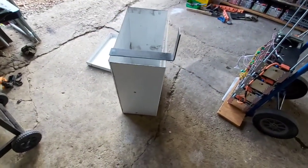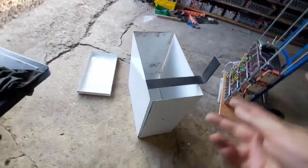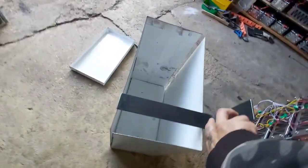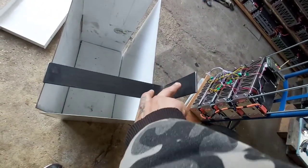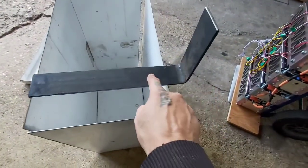And I did get the angles made as well. So these are the brackets that are gonna hold this together. And then it'll keep it another inch off the wall. Those will also get drilled to match the, there will be a cover on there, so I won't have to worry about where exactly that lands. But I'm gonna put one on top and one or two on the top facing that way, and two on the bottom, and I'll probably put at least one good anchor point on each of those. I was thinking of putting a little gusset in here too, just to stop that from bending.